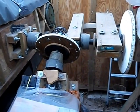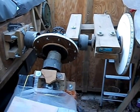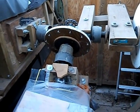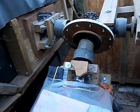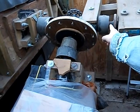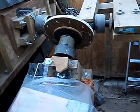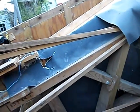You can see the declination and right ascension setting circles right there, and the clock drive is in that box. The polar axis is in a shaft that goes right down through here — I think it's got needle bearings in it, and the declination axis has needle bearings too. You see this narrow little shaft right there — that little black thing — that's one and three-eighths inch solid steel, and that's actually the actual declination axis. The whole thing is a little bit flimsy; it vibrates and moves pretty badly in wind.